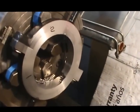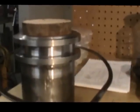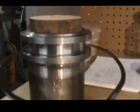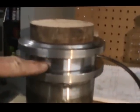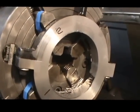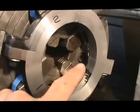Now my process here is to cut that bore so that when it comes over here, where it has to fit is in that groove right there of the hub, which is actually going to be the pulley once that's welded in to the other plates and the friction collar and everything is all assembled. The collar that I'm machining in the lathe now sits into this groove, and the clutch mechanism is actuated by a foot control. And that shifting collar here in the lathe, as you can see, is a two-piece unit bolted together. And that will, of course, be separated in the bore here.